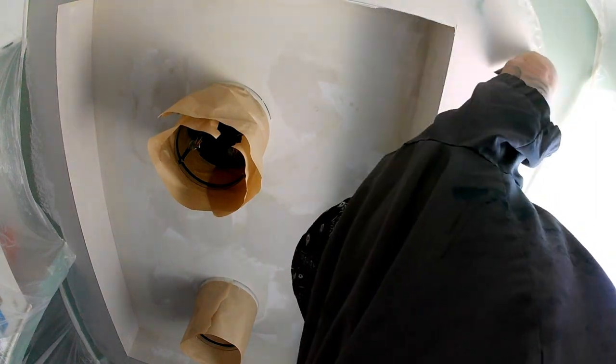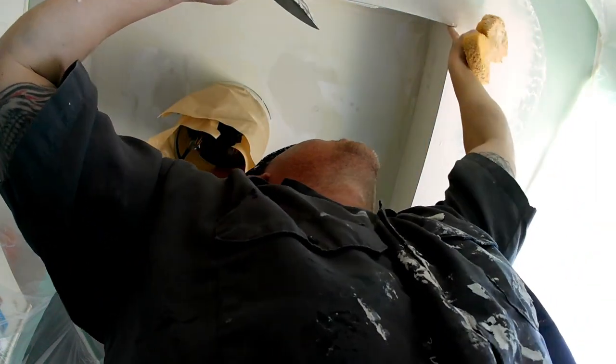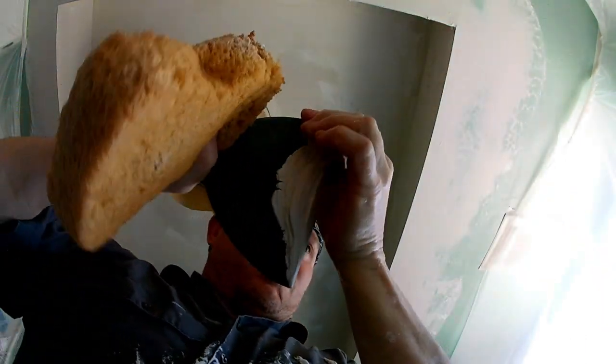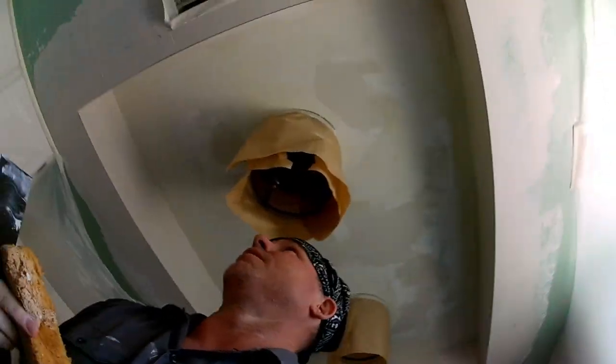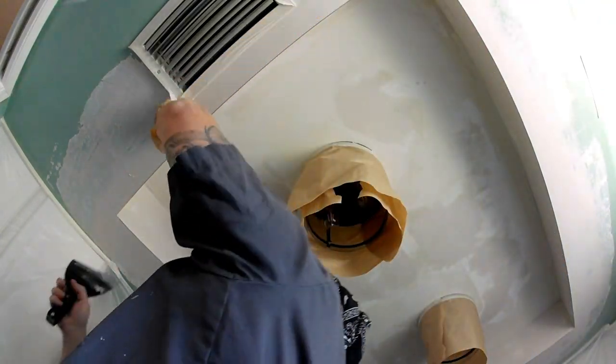It's just working with any kind of cement, quickset materials. This is how you manipulate materials, clays, cements, hot muds, stuff like that. Same principles go into stucco, patching, stuff like that. Take off the extra material. Just keep on going around until it all looks good. Clean your edge, around that vent real tight.